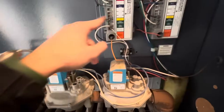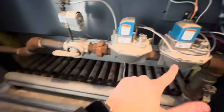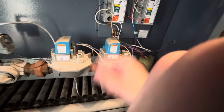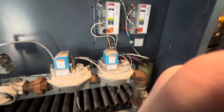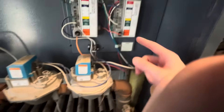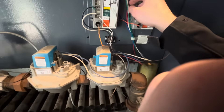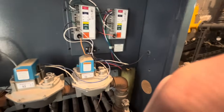This gets constant 24-volt power — our pilot valve. This is a solenoid coming right off the inlet gas before the gas valves, and it has constant 24-volt power whenever the burner circuit has power. So there's always a standing pilot, and we have a flame sensor here. It's never going to spark and never go into spark ignition because it's always going to sense flame. The spark is grounded; our 24-volt power gets to main power here.